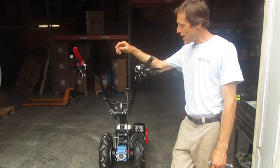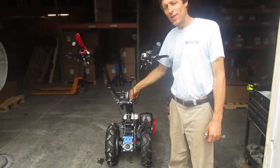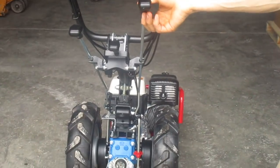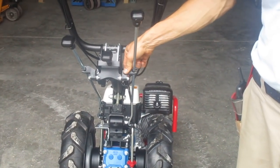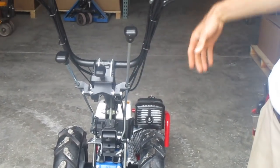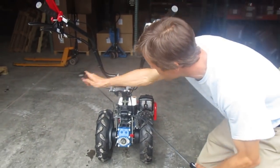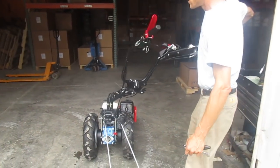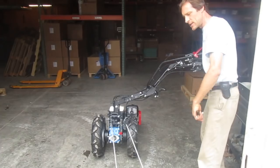We're going to talk about these little plastic shift lever holders on a BCS. These little plastic doohickeys allow very quick swinging around of the handlebars because you can just pop these shift levers right out and turn your handlebar column around to reverse your handlebars for front PTO implements.